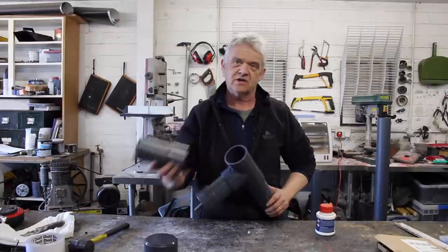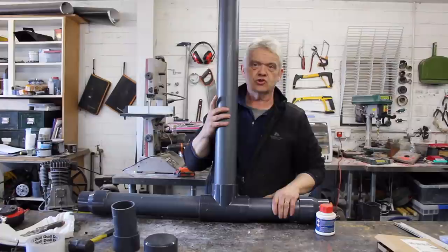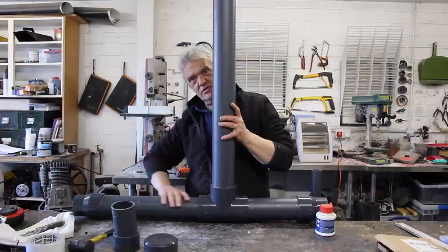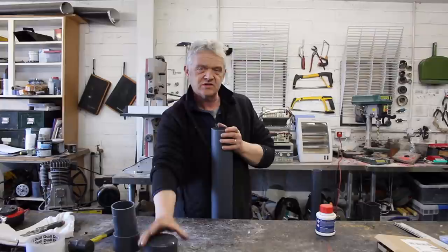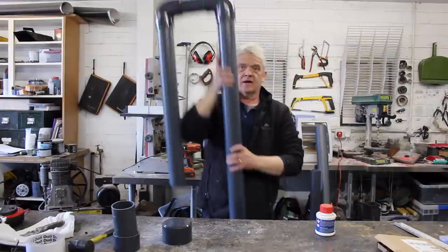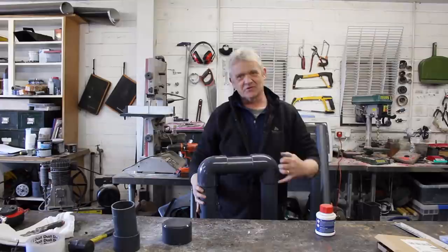That's the inlet pipe, and this is section two and three. The inlet pipe comes here, and then there's an expansion where it goes from 70 to 90mm, and this is where the gas comes out. It then goes into the collection pipe which collects the gas, and it continues its journey to the exit pipe. You'll notice the top is missing here too, and that needs a couple of adaptations before we can use it. And this is section four, the outlet pipe. It connects to the other joint and comes up here. It has a U-bend on it — not strictly necessary, but I put it on so the water doesn't splash everywhere. This exit pipe is one meter long.